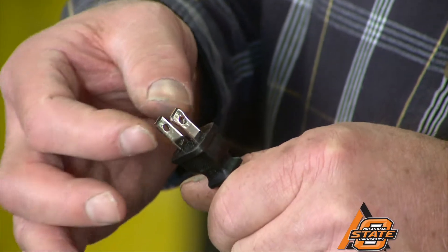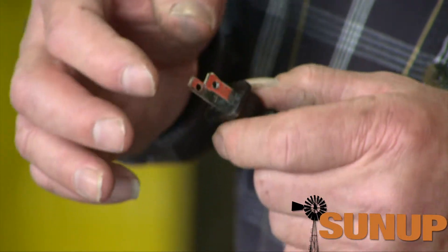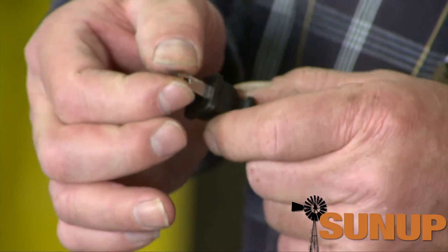You want to make sure that when you're plugging stuff in, the plug will only go into the outlet in one way, because one of these spades is wider than the other one. One of the slots in the receptacle is larger than the other slot, and that will only let it go in one way — that larger slot is your neutral.